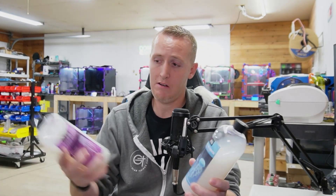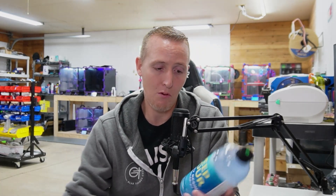So I thought the best case scenario would be to print this part out, take some silicone, make a little mold box, pour silicone in it, pull the part out, and that leaves us with the mold. Then we pour some resin in there and mix some color in with it so you can see it's mixed together really well. I'm super excited to do this — I've had this silicone sitting here for a while just waiting for a good reason to use it. Here we go.